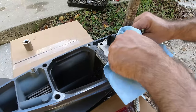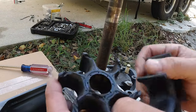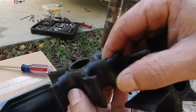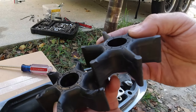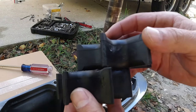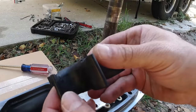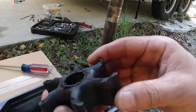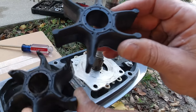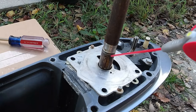Now we can remove the impeller. Look at how it's losing pressure — these little corners are already worn out completely. Look at the new one: if I don't have a smooth surface from the top, bottom, and side I'm losing pressure on cooling. That's why I've probably been losing a little pressure — I'm not getting a good seal on that pump. See how flexible this one is? This one's very stiff — it's already shaped into the housing. Now the next thing we're going to remove is the Woodruff key, but I'm going to put some WD-40 there because this has been there for a while.